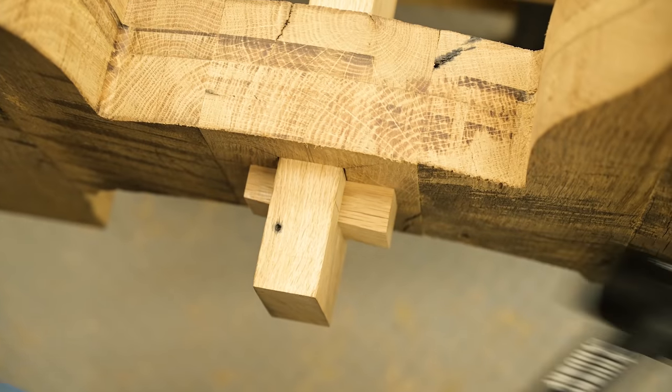But working with these wider slabs, I confirmed something I suspected, which is my planer knives in this beast are not totally parallel to the bed. So one side is actually cutting a little narrower than the other. It's making a slight wedge. So to counteract that, what we're going to do is send it through, spin it around, send it through again. My geometry-savvy viewers are going to say, oh, but isn't that probably going to make a slight peak in the middle?